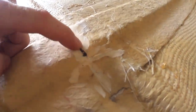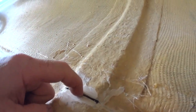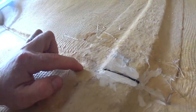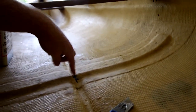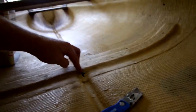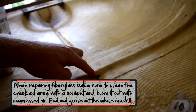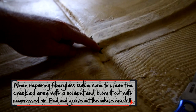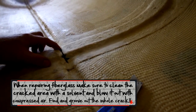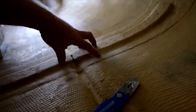Just opening out this crack to see how bad it is so that we can fill it with fiberglass matting and resin. There's a piece of wood that runs inside of here, but it looks like it's not connected on purpose so there's some flex. But this should all be joined properly, so we're going to fill this crack with the fiberglass matting and then do a couple of layers on top to get the reinforcement, kind of like what was here originally.